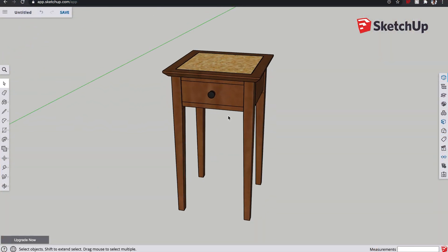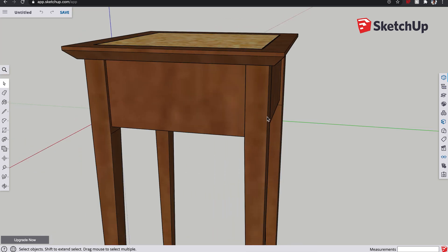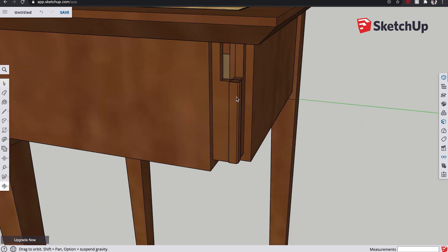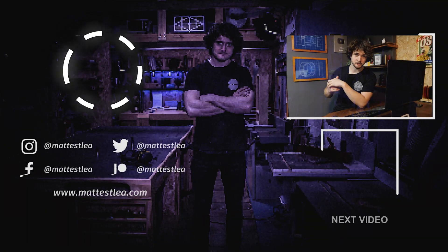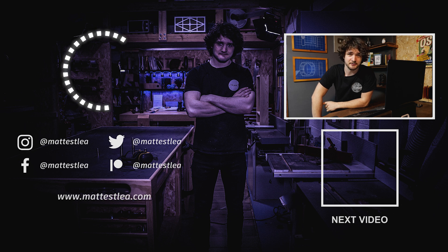That is pretty much the table complete. At this point you can look at it and know what materials you're going to be using, where the colours are going, and that all of your joinery is going to fit nicely - with the exception of these back legs where the tenons are intersecting with one another. Whether you choose to update this on the model is up to you, but for me I would probably just keep it like that, and when it comes to making I know I've just got to add a small chamfer to the end of those tenons. We've only got one more thing to do, and that is adding dimensions and talking about exporting if you plan to redraw this in CAD, which is what we'll focus on in the next video. Thank you very much for watching - please press the like button, subscribe if you haven't already, and I'll see you in the next video.